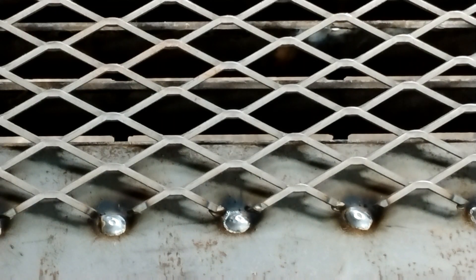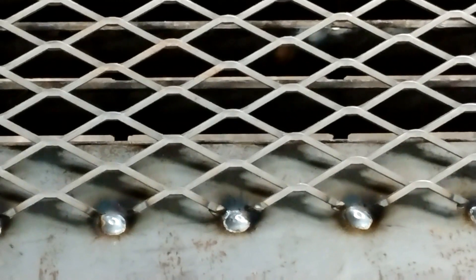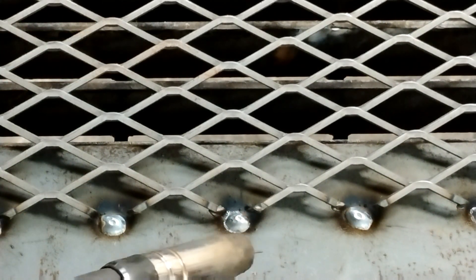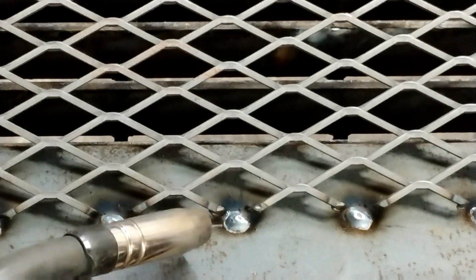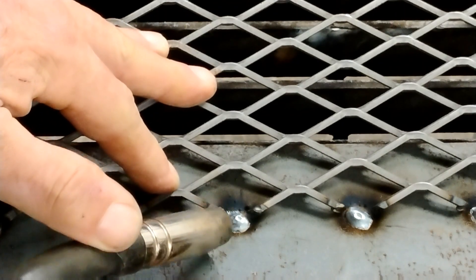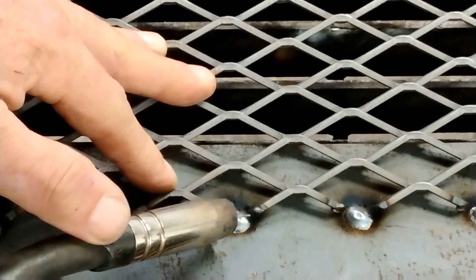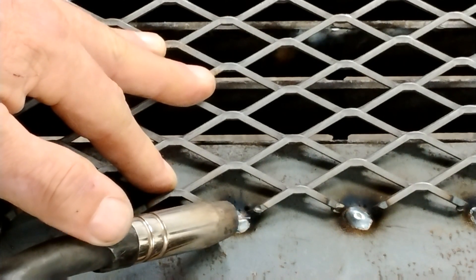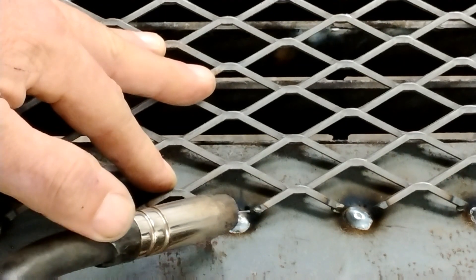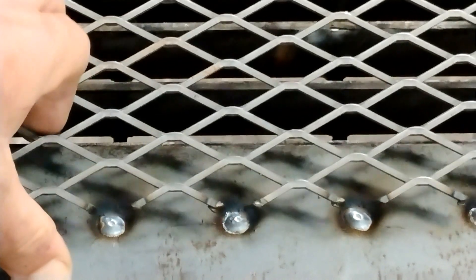Okay, so I did this on purpose, but you can see that's not even attached. What I see a lot of people doing is, for one, they've got their settings too high, but what they'll do is they'll try to weld right where that joint is where they touch, trying to make like a fillet weld. All it does is burn the other end up, and they wind up trying to chase it and it just keeps going up. That's not the way to do it, and you wind up with this.